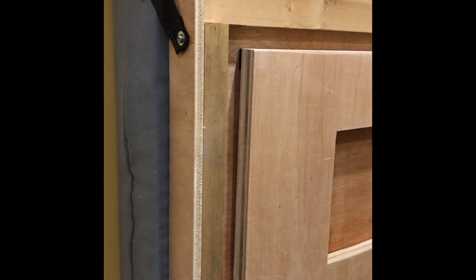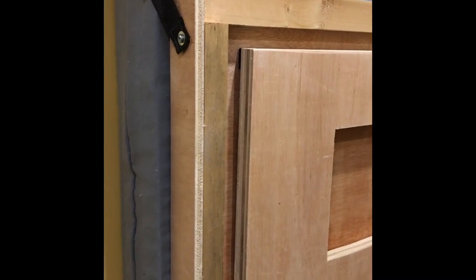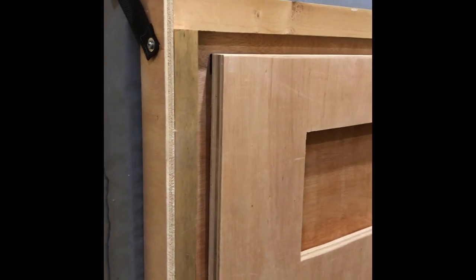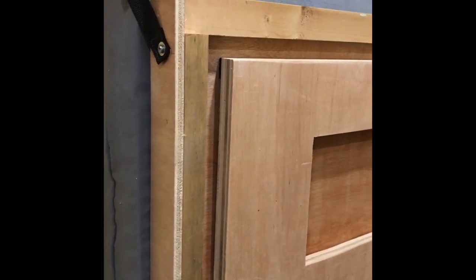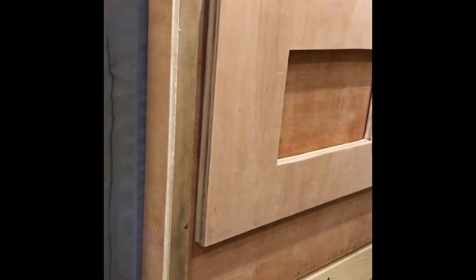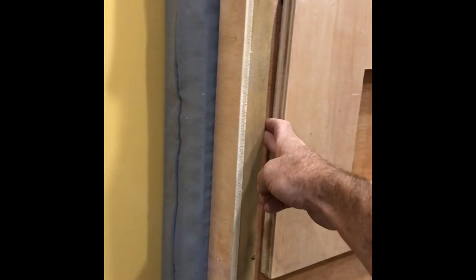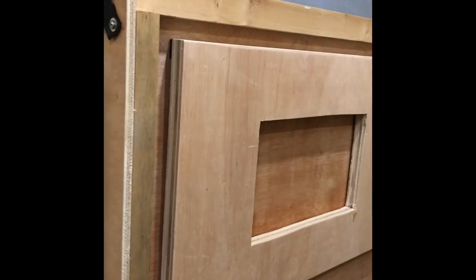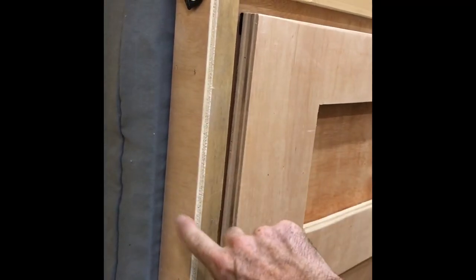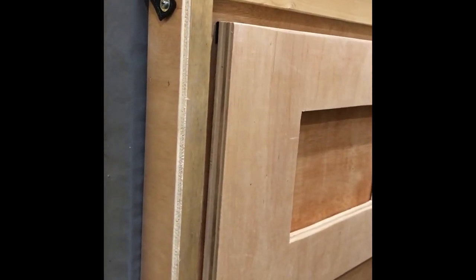The beds are pretty much all made of half-inch plywood and one-by-fours. I don't think I used any two-by's in the building of it — unless you're building a house, two-by's are usually overkill. Each section has a half-inch plywood main section with some framing around it which is ripped-down one-by-four. There's a little bit of reinforcement on the outside, a little edge to hold the cushion on, and then this is the leg.